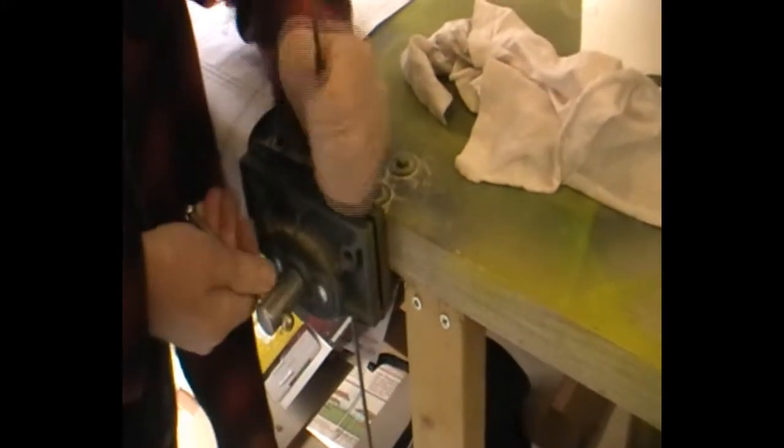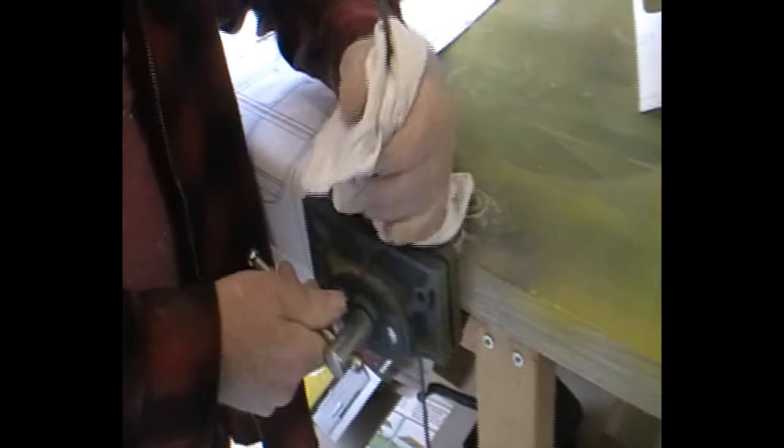So what I do is the old brute force way, as you can see in the vise. And I find it easier because you've marked it with your permanent marker, and then you brute force bend it, keep bending it with a cloth, so it's easier on your hand. So once you've bent it into a reasonable shape, keep going back to the picture to get the right angle, and you'll see the results. Okay, it doesn't have to be exactly perfect, but that's close enough.